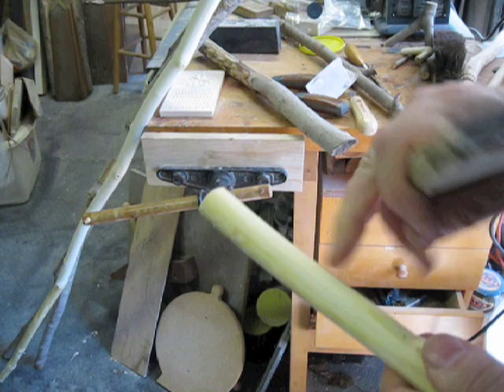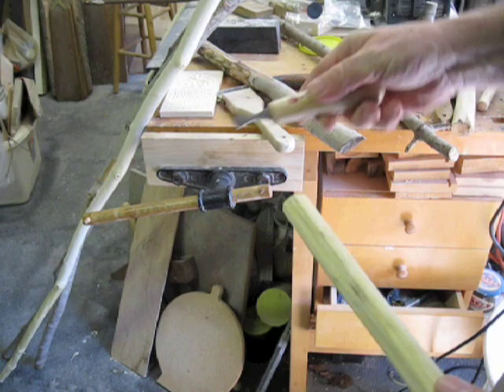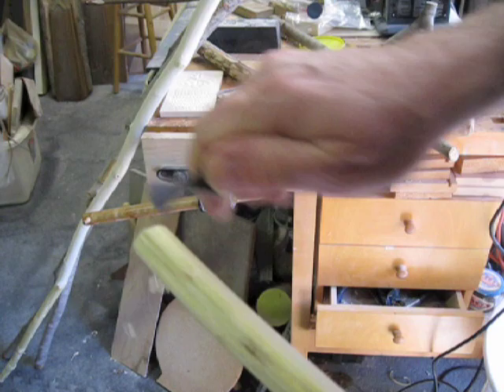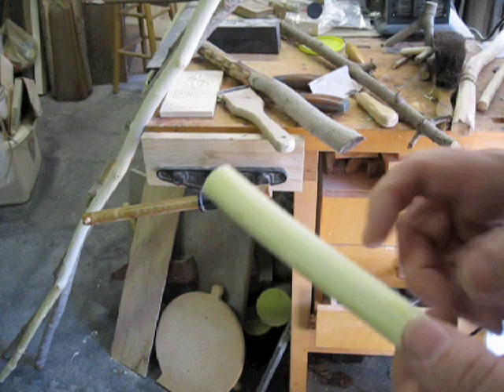The handle's comfortable so you can just scrape away — boy, that gets everything off. It is a flat blade, so it gives you a series of little flat facets. You don't really want that. So then I use a Flex Cut tool — I have a set of these. It has a round profile, and as I'm rotating my stick, that takes all those last little high spots off. You don't want to sand it — that's going to make it worse. It's already as good as it can be. If this is sharpened properly, you're going to get shavings from both of these tools, and that's giving you a nice finish.